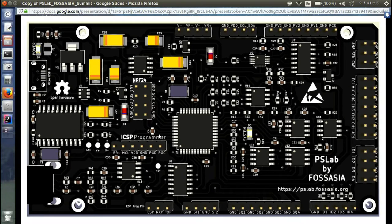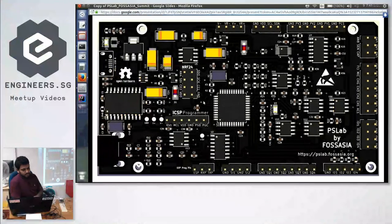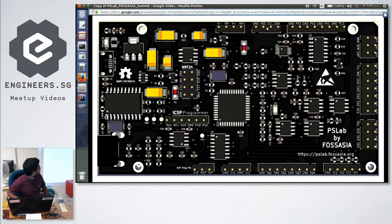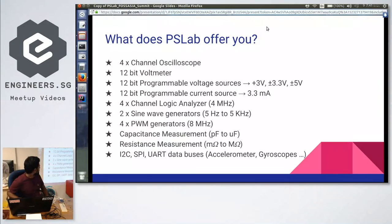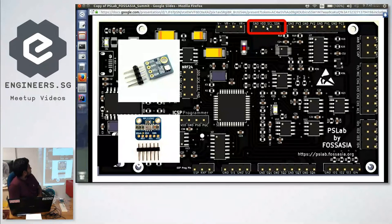Yep. So, can you talk a bit about using external sensors? Yes, we have the I2C connector on the top. As I2C is made to connect so many devices using only four wires, we can connect plenty of devices, like accelerometers, gas sensors, barometric pressure sensors, light sensors. There are so many sensors available in the market, and they're all compatible.